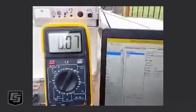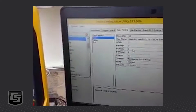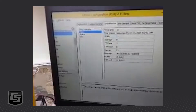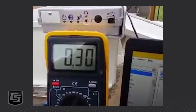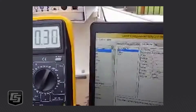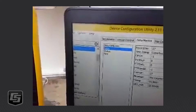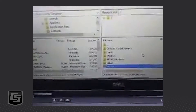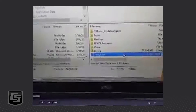So we're just going to take a look at a little demo I've got set up here. I've just got my CR1000 running a simple program here. We're taking a look at the power draw. What I'm going to do is tell my data logger to FTP some data. As soon as I started that, the data logger attempted to communicate with the internet. It caused the 9502 to attempt to get a narrow beam fix. We can see it didn't get it right away — it takes a few seconds to get the fix. But there we go. FTP data went to zero and our FTP result was negative one, which means success — we transferred our data. So we'll go and take a look at our FTP site. Let me just refresh this. And then we see our file showed up — about a two kilobyte file there that contains our CSV data.